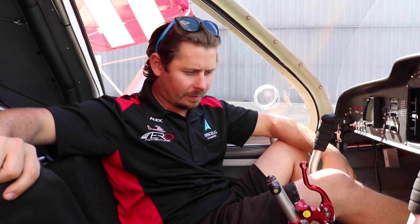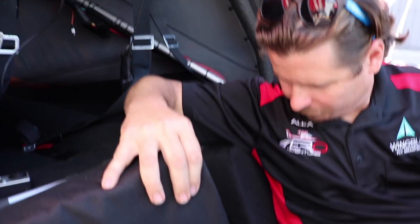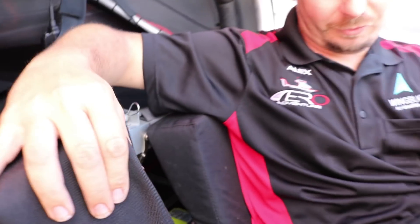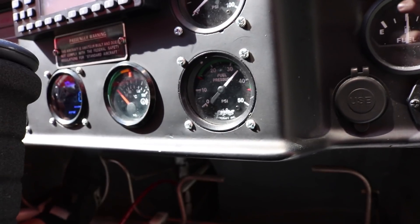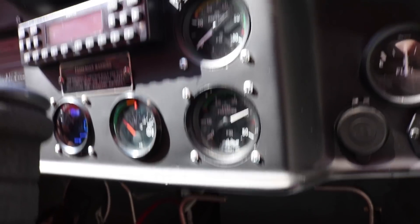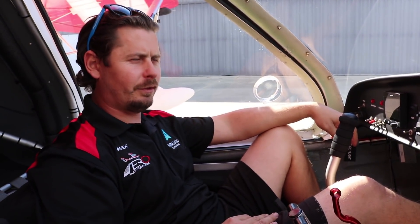Where is the fuel located? The fuel tank is right between the seats, under your luggage deck right here. You can physically turn and look to see where your fuel level is. In this case we're about a quarter tank visually, but given this is a 23-gallon tank and we're at a down angle because it's a tailwheel aircraft, we probably have about half a tank. Turning on the master confirms it's right at half — so about 11 gallons. We burn close to five gallons an hour, so we easily have two hours of flight time. A good hour of flying with your reserve, and you're safe.